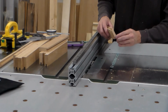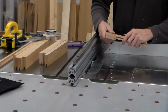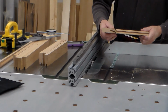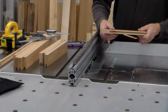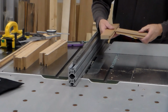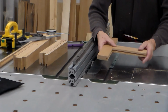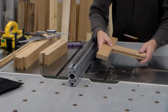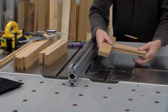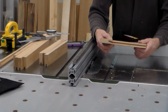Let me cut this off on my tab right there that just broke off. That's kind of what I'm looking for. So I know that's it right there. Beautiful. Just a little slip fit. No wiggle. Beautiful. Flush on both sides. So that's what we're looking for. If I take this and try to wiggle it, you can see I'm moving both pieces. That's great right there.